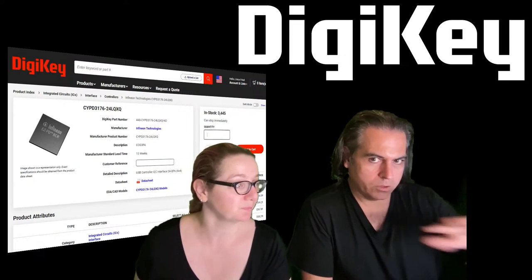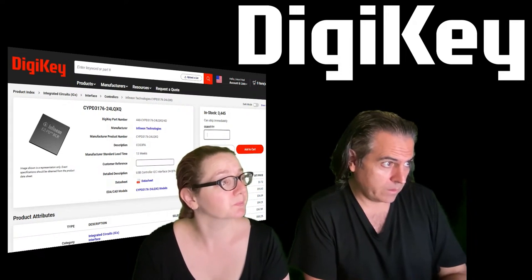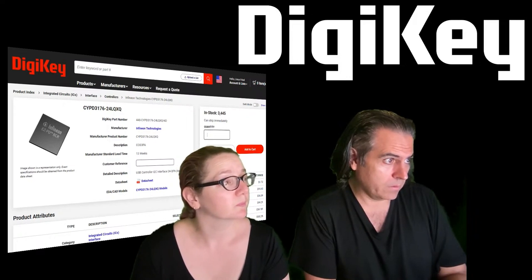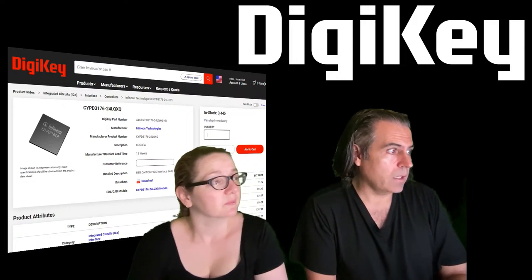So here's a question during this segment. Can this chip only pass voltage if it's the one requested, not below it? I've seen chips that just pass whatever they get as long as it's below or equal to what's requested. I don't feel that's safe. Some devices might break if it's below the rated voltage. Maybe not on computers that use linear regulators, but some switching power supply units won't work and literally pass higher voltage if the input is not high enough, which is dangerous.